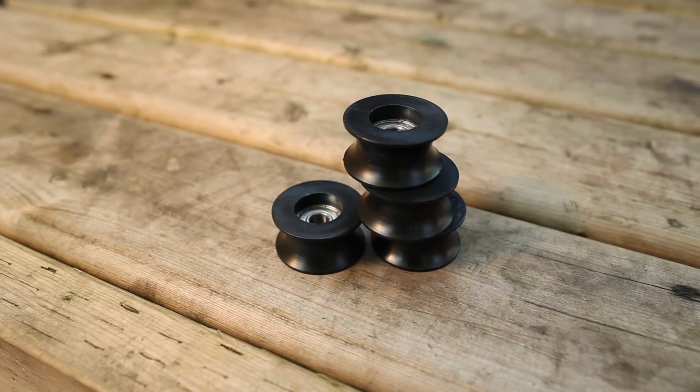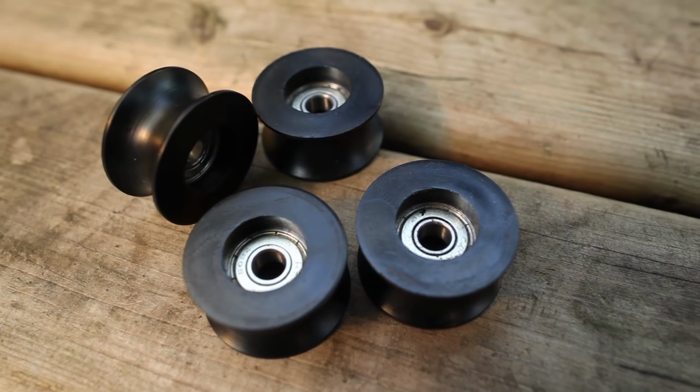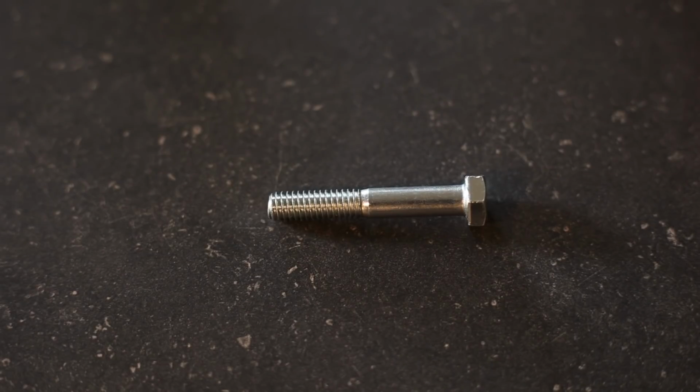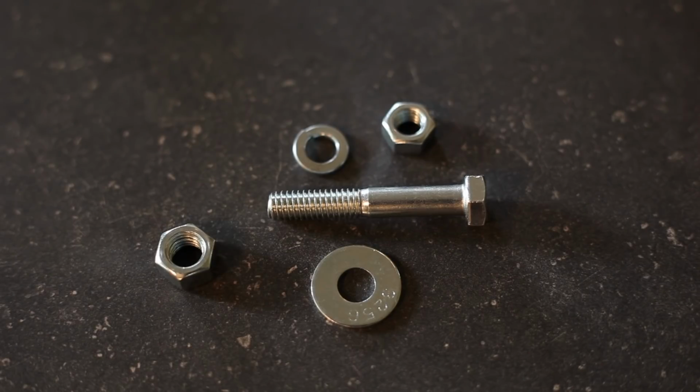In order for our center plate to glide across the rails, we are going to be using 8mm groove guide pulley ball bearings, which I ordered online. There is a link for these in the description of this video. We will also be using a 5/16 inch by 2-inch bolt, along with a flat washer, a locking washer, a 5/16 inch nut, and a 3/8 inch nut.